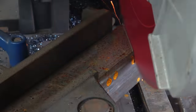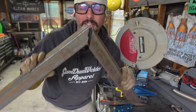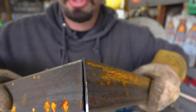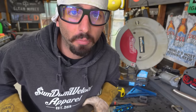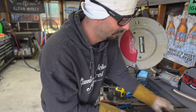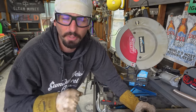One easy way to check your 45 cuts: these were already cut to 20 inches and we just needed to put 45s on either side to get a nice 90-degree angle. Look at the edge of the square tubing — you'll notice there's about an eighth-of-an-inch wall left right there, kind of flat instead of real sharp. This is actually going to help for a stronger fit and a stronger weld — we'll have a little groove for a happy little weld bead. Whereas if I cut them right to the edges, I'd have to make a fusion weld without as deep a penetration. However, we made a lot more cuts than we actually needed to. Let's speed things up.